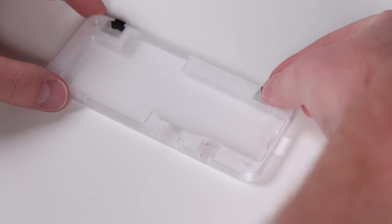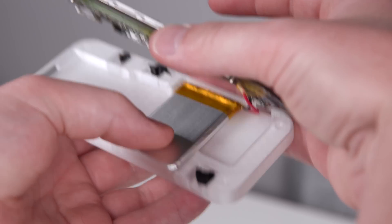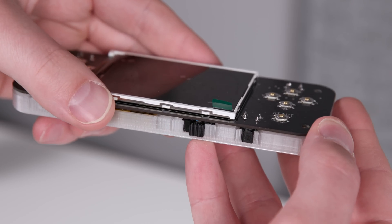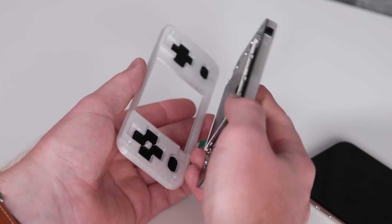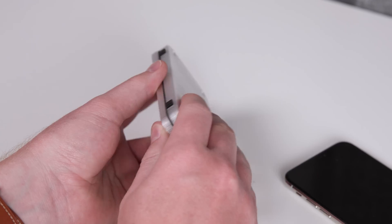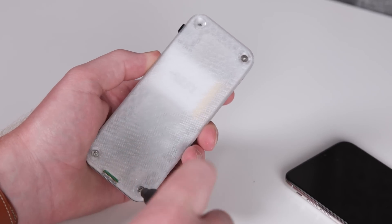All you've got to do is put the buttons inside the bottom half of the case, then push the battery into place, and drop the board in — sometimes the buttons slide around and it takes a second, but you'll get it. For the front, it's easiest to put all of the buttons in the enclosure first, and then drop the lower half into the front. All we have left is to close it up with four M3 12mm screws.